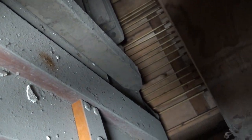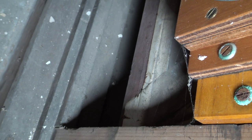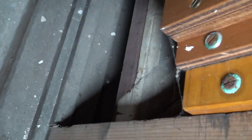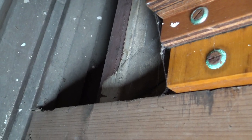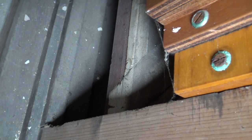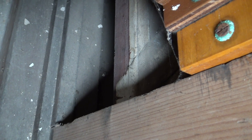You'll see, hopefully, that there are weights on top of this bellows to give it the pressure. And then underneath, you'll see the hinge. If we can just get lower, you see that white leather there between there and the floor is the hinge of one of the feeders, the very feeders which have been removed from the Forster and Andrews organ. So it's still got those underneath. So if those non-return valves are a bit dodgy, you've got a wind loss because of it. So if this came up for overhaul, probably be an ideal thing to actually remove them.